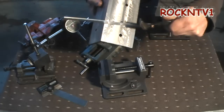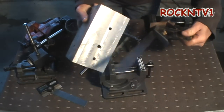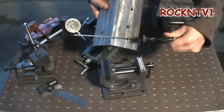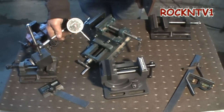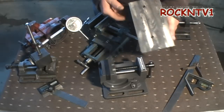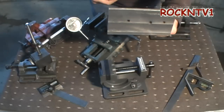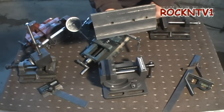...which are not NASA perfect. But when you compare three or five of these together and you come out with a thousandth of an inch, some feeler gauges, and your dial indicators, then you can come up with a pretty close number. And I'm absolutely certain that I can bolt that on top of my mini lathe or my Logan lathe and come out with a thousandth.